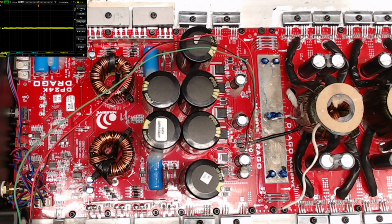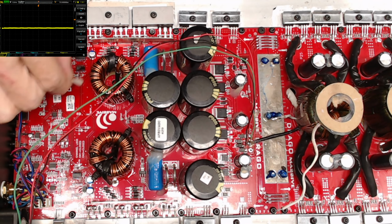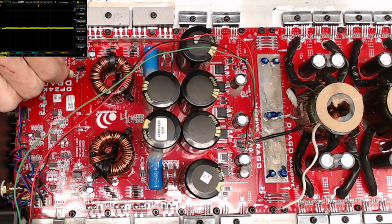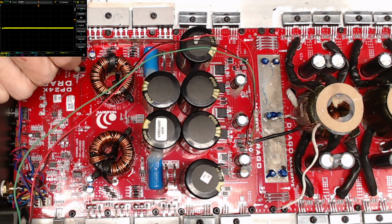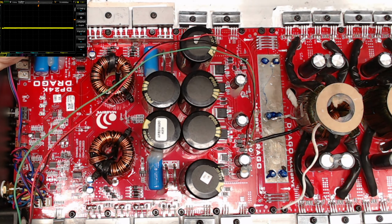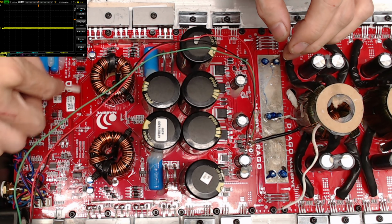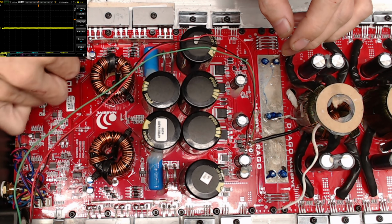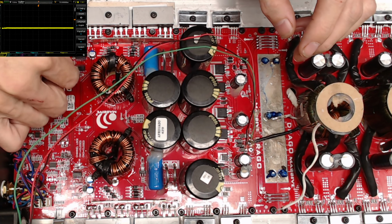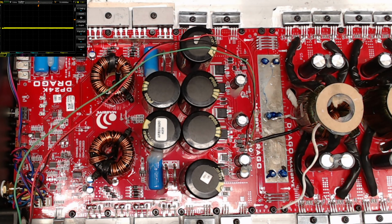The Amtech flux works great. It can be a little thin. I'm thinking about probably going with a little heavier flux, especially when you use hot air. This flux here, the NC 559, it'll pool out pretty wide when you hit it with the hot air. I have never really tried any other thicker flux, so I may try that in the future. But just cleaning up the flux here with the good old trusty Q-tip.